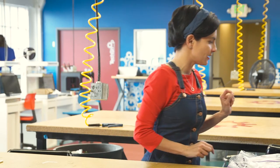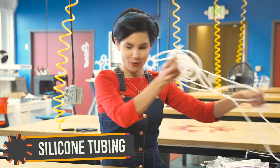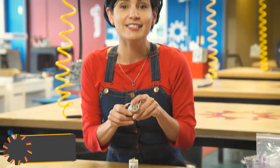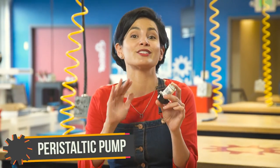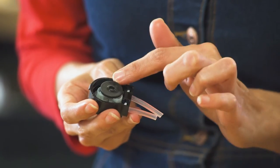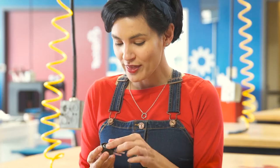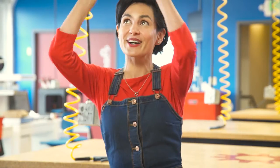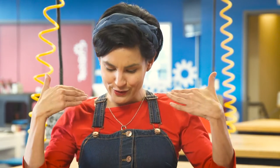To do that, we're going to need this silicone tubing. I've got a whole bunch of it here, and some pumps. This is a peristaltic pump, and it's really cool because it works a lot like your digestive tract. Inside are these rotating mechanical rollers that squeeze a section of the tube. When they rotate, the liquid inside the tubing gets propelled forward. The muscles in your digestive system contract in sequence to form a ripple known as the peristaltic wave. This wave pushes food down the intestine and out the other end in much the same way.